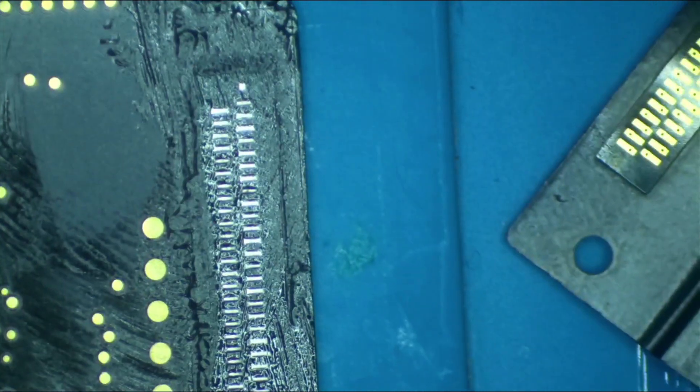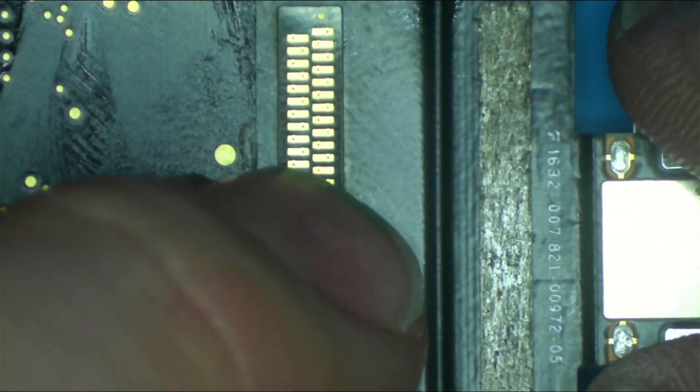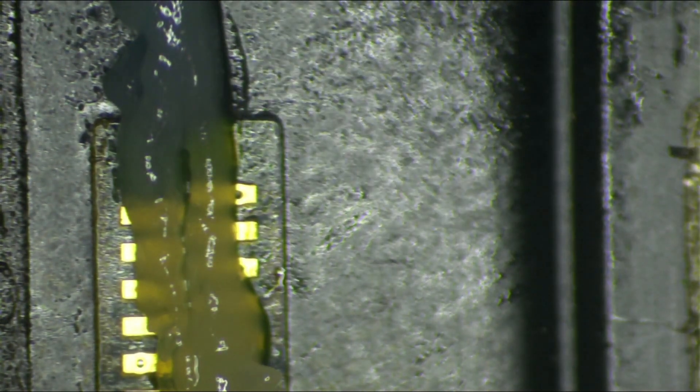What I'm doing is lining up these little translucent tabs — this one lines up with that little square marker there, and there's another one over here. As long as they line up — one lined up, two lined up. I like to pin it down with my fingers on one end, then zoom in, chuck down a bit of flux, and come in with a clean tip.